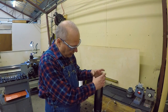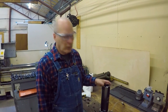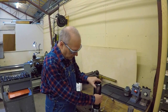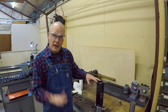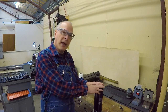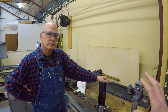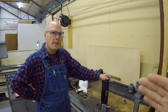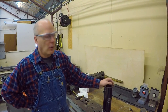Is that a purchased product or did you make the assembly? Well, this piece I made — this is Sandvik. At the company I worked, they made big eight-inch ones that'll cut six feet deep or more. They made heads about that long — the head is what goes bad. You can see on this one there's a notch cut here for chip clearance, and you can see where the chips have been wearing it right there. After a while they wear out, so they had a couple bolts and a tongue on the inside — you could pop the head on, make the shanks any length you want, and just replace the head when it goes bad. The shank doesn't get wear on it. This won't cut a real accurate hole like some drills — it's designed to get a bigger hole in there in a hurry.